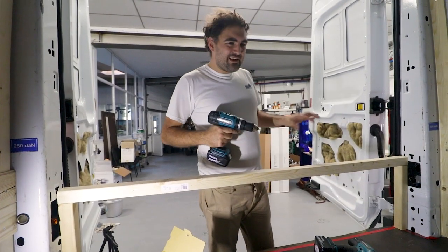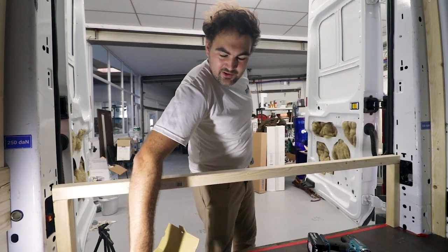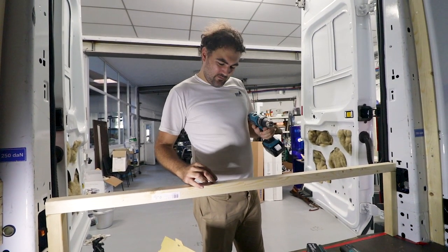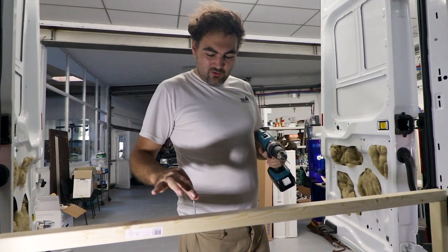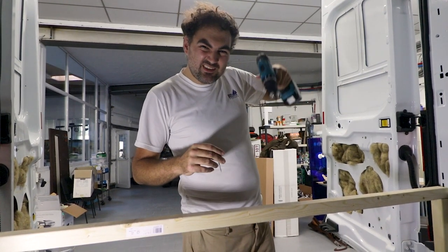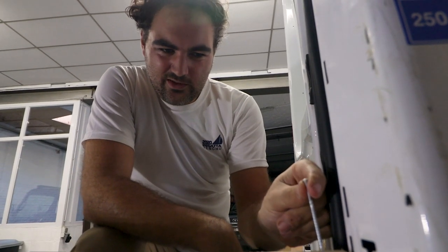So I have a friend who's a bit into woodworking, gave me some tips. He said, be sure to use some good screws and to pre-drill the holes that you're screwing into, because this is a very long screw. It's not a super thick beam, and there's a risk that if you put in the screw, the wood will shatter a little bit, especially towards the end where most of the screws will go. So we're going to be pre-drilling these screws. And just for the sake of sturdiness, we're also going to be putting in maybe two screws if I can. Not sure. Think that'll fit? Let's try.